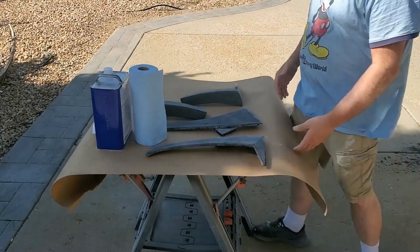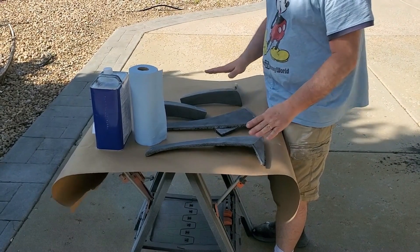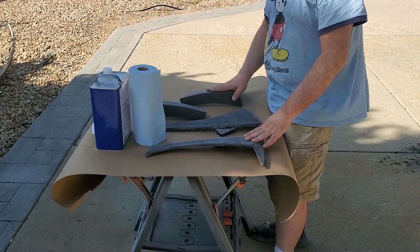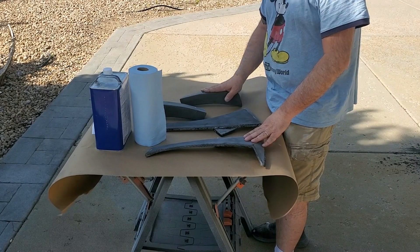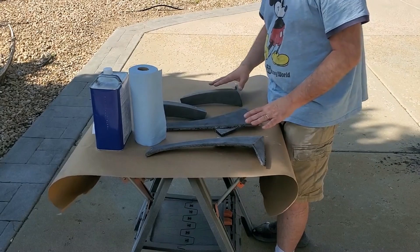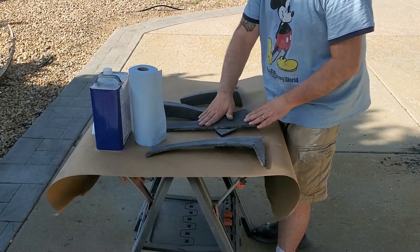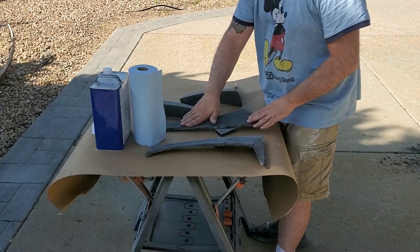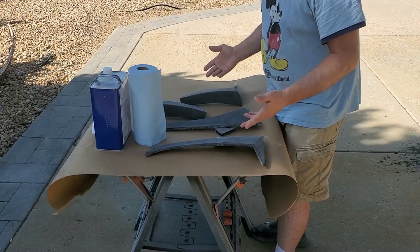The wind picked up, but I saved you guys from the sanding of these. I hit them down with 320 grit. The thing to be aware of - remember when I told you I was using pretty heavy mat for the carbon fiber? Probably about twice as thick as normal. The good reason to use that for skinning is, if you have nice smooth parts like this, when you're sanding you'll actually find you have a little bit more forgiveness before sanding through to the carbon fiber. So if you do sand through, you're not going to sand all the way through to the base layer and have to redo the whole thing. That's one of the advantages for using heavier carbon fiber.